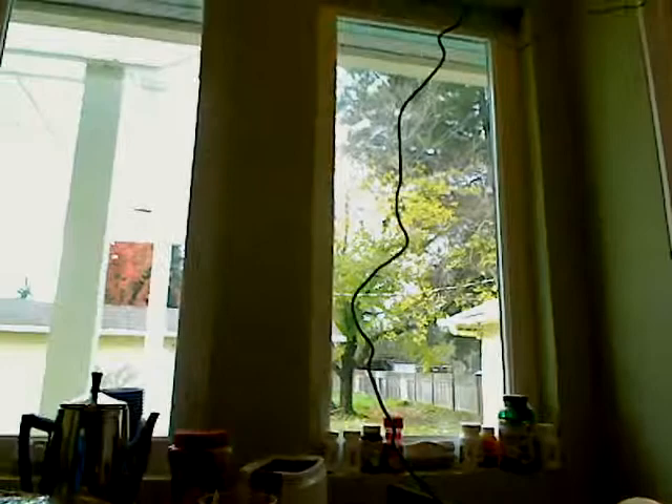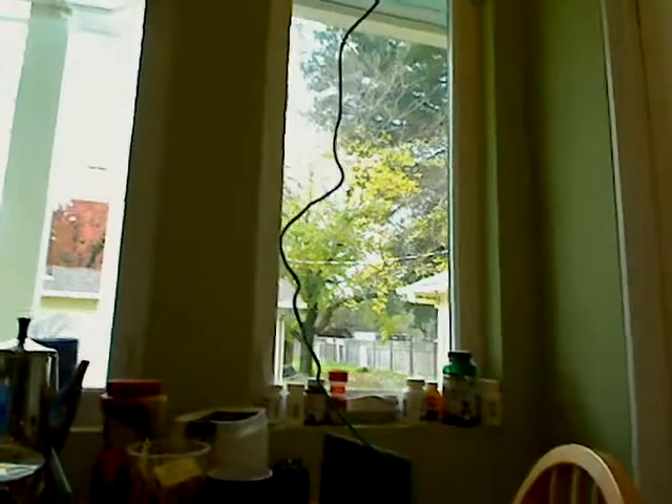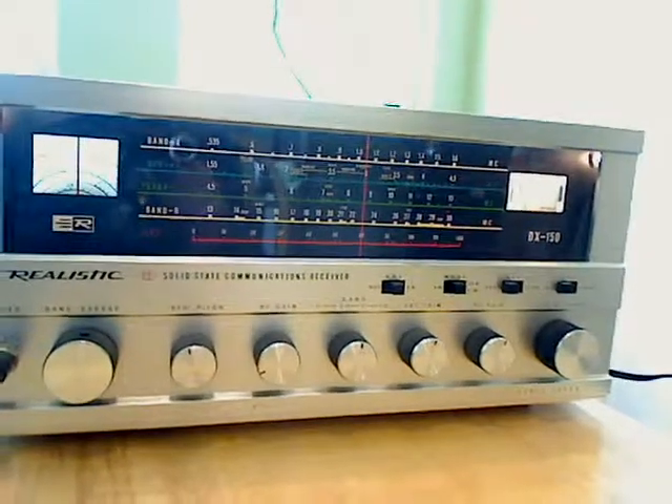I should mention the antenna I'm using is really just a piece of junk — it's not the type you would use for a ham radio receiver. On the 40-meter or 20-meter band, a typical ham operator would have antennas custom-built to tune to those frequencies. In other words, a 40-meter band would really call for a 120-foot antenna, either a full dipole or a half-wave antenna. This is just an 8-foot length of ground wire — and you can see my fluorescent lights up there, so it's also daytime, which is the worst possible time for DXing and receiving on the ham bands. But what the heck, it came in good and I'm thrilled to have done the job.